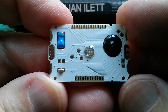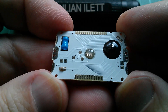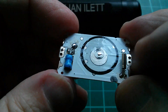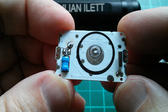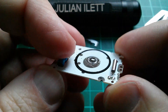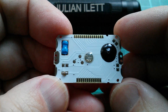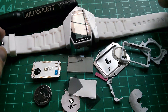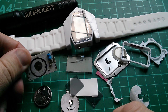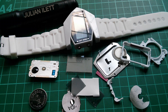Well, I have to say that the inside of this watch is actually quite nice. It's got a nice neat layout. The LED is not some bodged-on afterthought — it was sort of designed to go in this. This is a nice piece of design work. I still don't know what that blue thing is. But when they stick this in the outer housing, it's the worst watch in the world. So what on earth were they thinking? Why make something so electronically nice to look at, so awful when it's in its finished packaging? And so there it is, completely broken down, complete with liquid crystal display, polarising filters, very nice circuit board. But I think the only thing I'm actually going to keep is going to be that battery, that could come in quite handy. And that's the teardown.